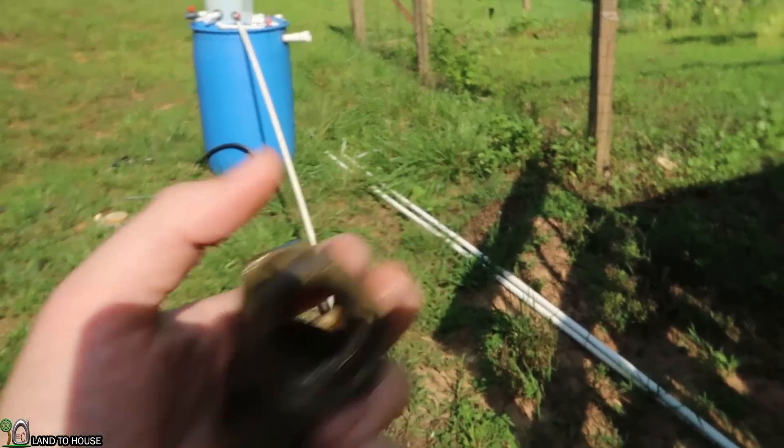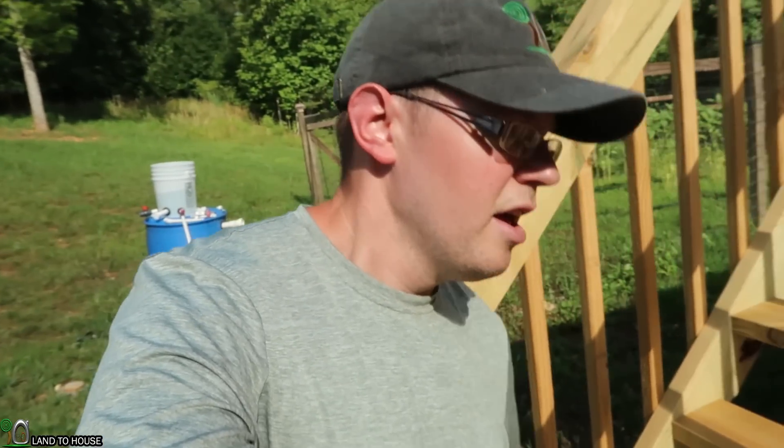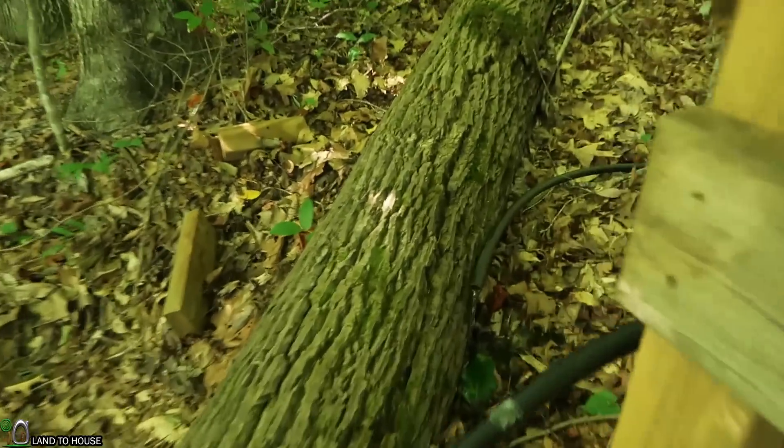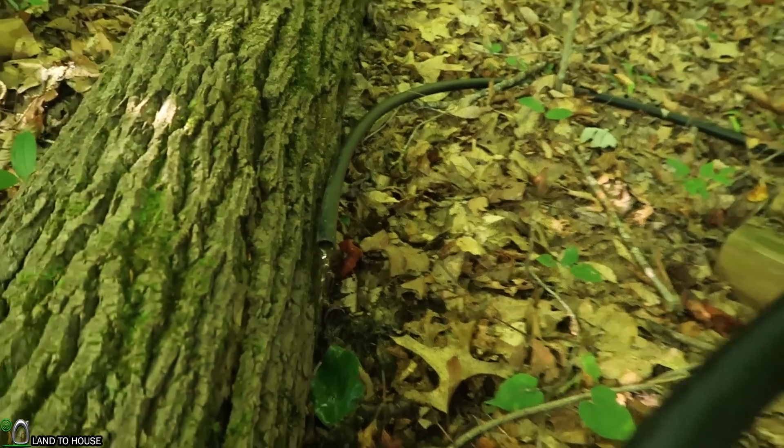I am considering improving the quality of the ram pump valve. For the two-valve test, I used about 10 gallons of water, turned off the water, and went down and replaced the valve. By the time I came back up, I noticed my tanks had been filled. They're doing quite well with that new valve — this thing replenished 10 gallons in no time at all on my storage tanks.